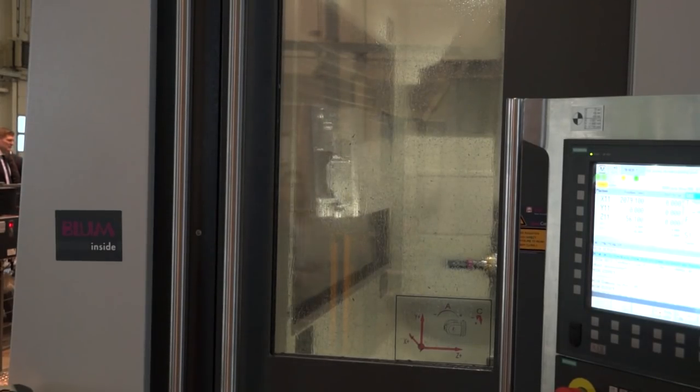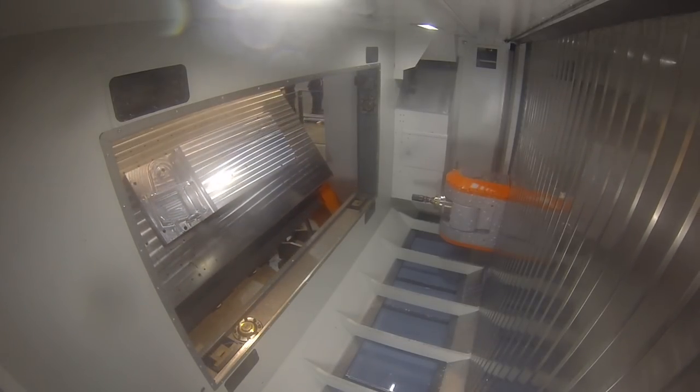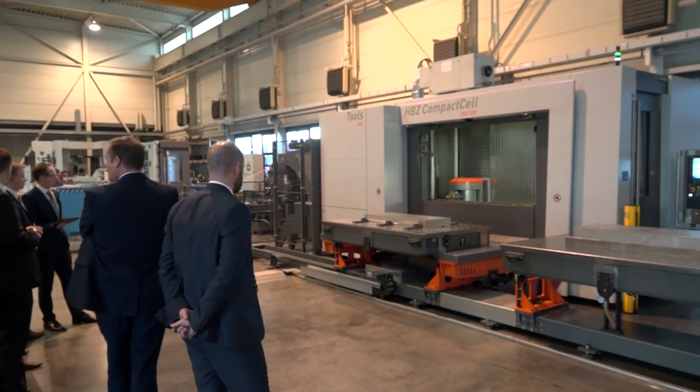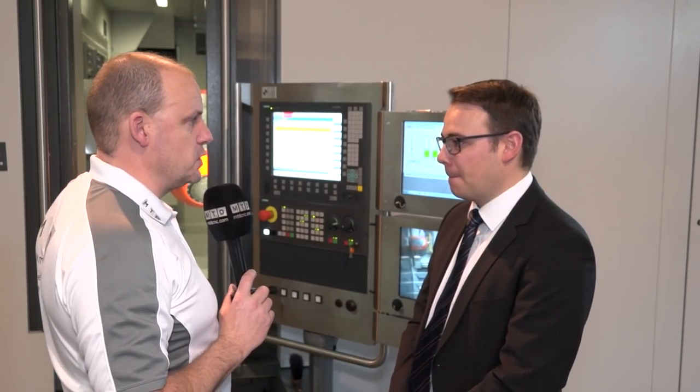It needs a very fast processing time, which is what the Siemens has to crunch the code to get it into the machine and get the machine moving as fast as it is. Yes, for aerospace parts we always have complicated 5-axis simultaneous contours and the Siemens control has a perfect fit for handling a lot of commands that need to process to get a nice and smooth part surface quality. That's the main target — get a nice surface. Surface finish is key and you can do that if you've got a solid machine.